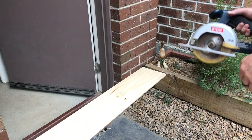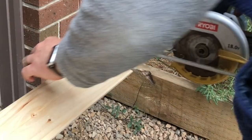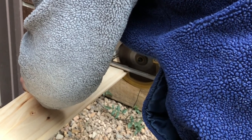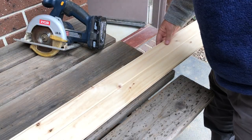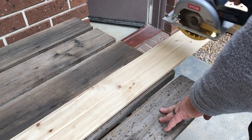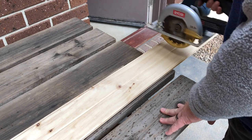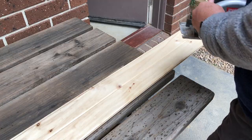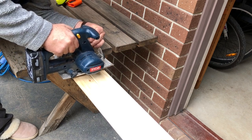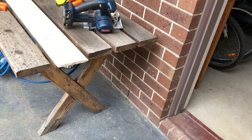Okay, so to start with I'm going to do a test cut up here, just to see how this saw performs on the soft board. That's a beautiful result — have a look at that, I've just stopped halfway through. It's actually better than the cut that it came from the hardware store with. So definitely I'm going to be using the little cordless Ryobi. We're all scribed off here at the 684. I find if you try and cut following the guidelines in the front here you end up all wobbly, so I'm going to drop down on the cut line to keep it straighter. That's come out totally square, totally perfect — happy with that.